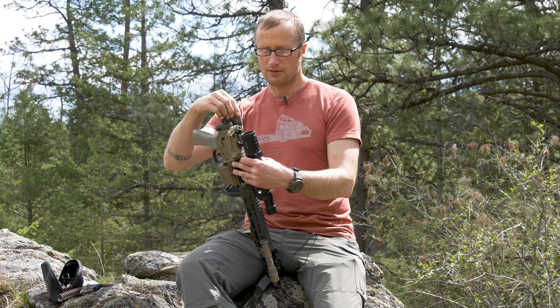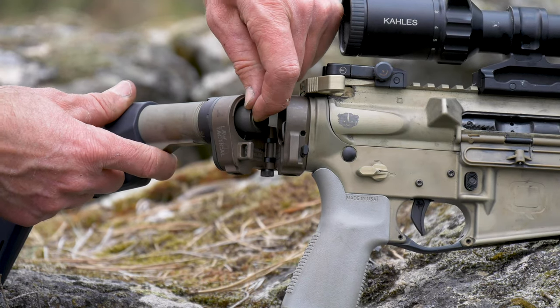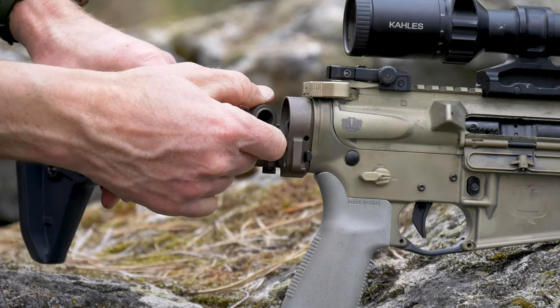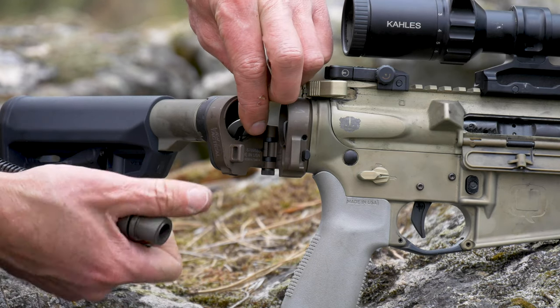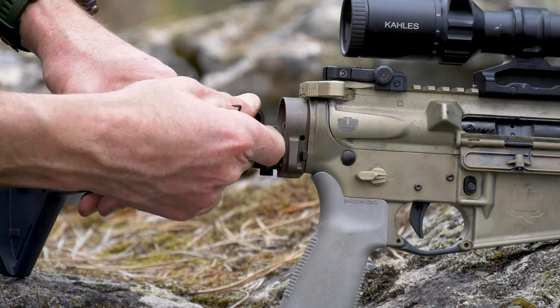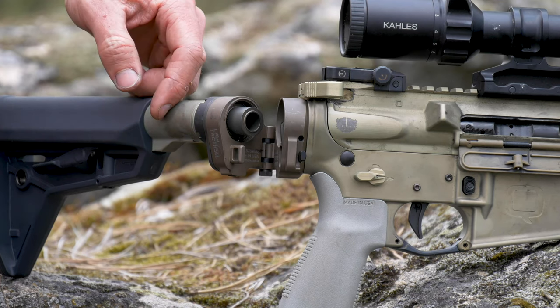So that when we touch this there is basically no play — this is basically just under a tiny bit of pressure by our retaining pin. Because there is ever so slightly a little bit of play in between this captured spring and the back of our receiver extension, we're going to go ahead and take our captured spring out, depress that retaining pin, pull it forward, get that out. Now we're going to take one of our shims — our shim is made so it'll go down over this — we are going to try and keep it square so it does not bind, and push it down until it finally seats. At this point there is zero wiggle room between this captured spring and the back of our buffer extension, or receiver extension — the buffer tube.